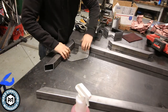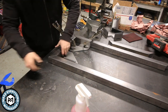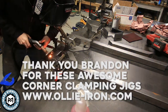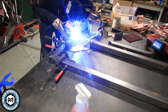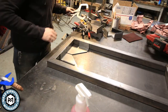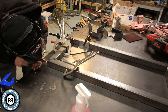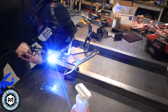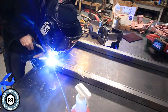I'm using 2x2 tubing here with a 1/16-inch thick wall, and right now I'm clamping it up with these awesome corner clamps from Ollie Iron. Brandon hit me up and sent me these to try out — they are absolutely going to change the way I work in my metal shop. They make jigging things up really quick and easy. I checked all six of them for square and they were all dead-nuts perfect.